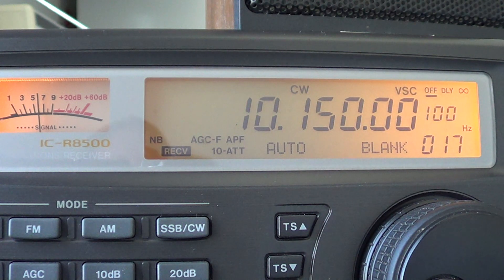The 30 meter band is kind of a mixed band. It sits in the middle between 7 MHz, which is mostly a local daytime band and a good DX band for the evening, and 14 MHz, which is more of a daytime band good for DX. So it shares half the characteristics of each. There are periods of the day when it's very good for DXing and periods where it will be more local. But because it's higher than 7 MHz, the distance for daytime propagation is slightly longer.